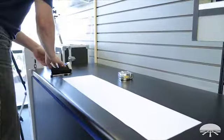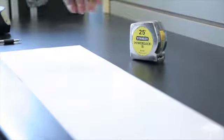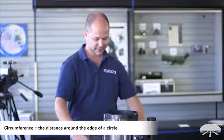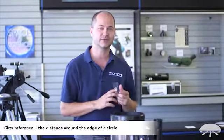Overlap the paper and mark the edge. The nice thing about this method is you can overlap the top and bottom of the paper so you know you're exactly parallel to the tube's circumference. Once you've got the mark, take it back to your table. I like to tape down the end so it won't move during measurement. Then just measure from one edge of the paper all the way over to the mark you made. In this case I again get 29 and one eighth inch — so the circumference of this 8-inch telescope is 29 and an eighth inches.